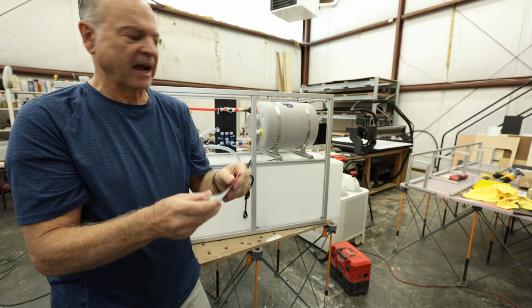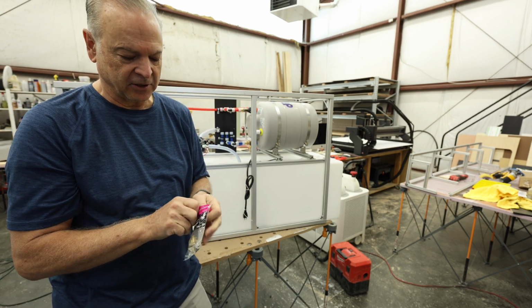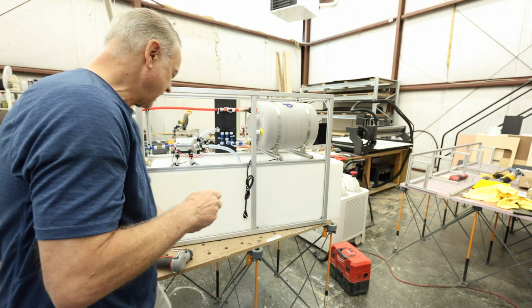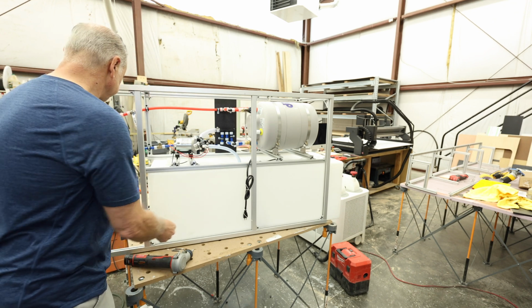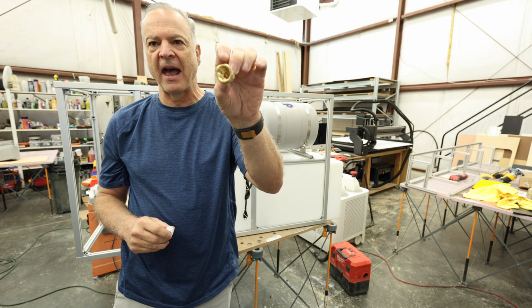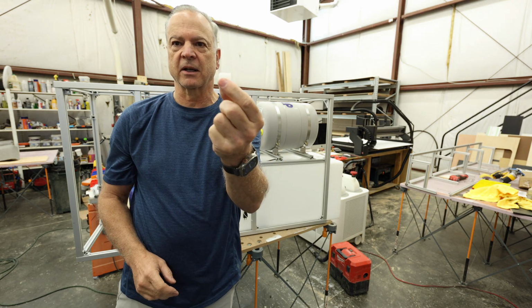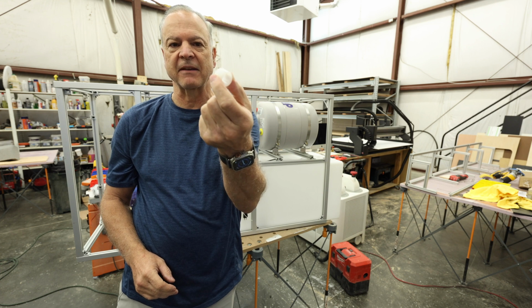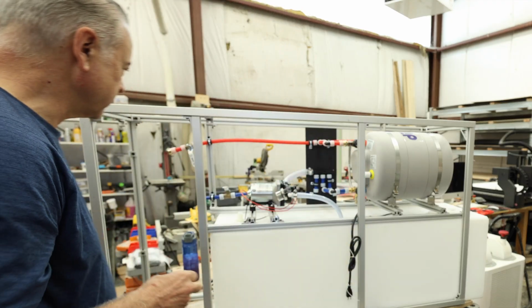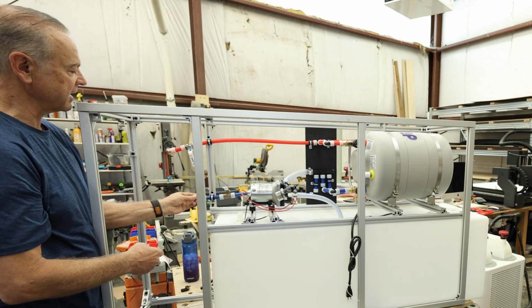I've got everything put together. I just saved this one last fitting to do on the video. Here's all you have to do. It requires the fitting. This is a female 1/2-inch adapter, and it requires one of these little expansion sleeves. All you do is slide this over the end. I'm going to attach this right here.